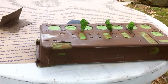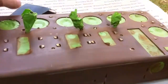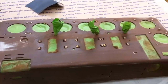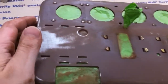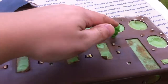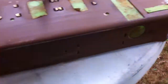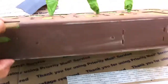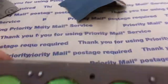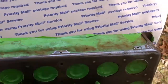We're going to do a quick update on the Radio S60. I have prepped the chassis for sanding and actually started the sanding. I masked off all the tube sockets, the wires for the tuning condenser, covered up the escutcheon for the serial number, and sealed up the bottom with green painter's tape — and did the same thing at the back.